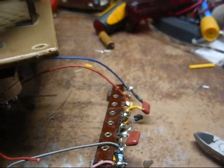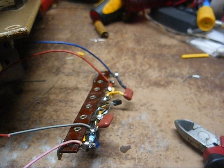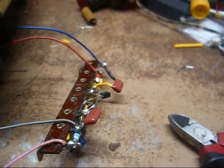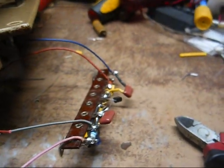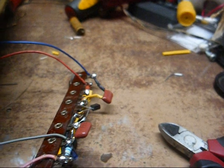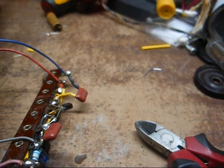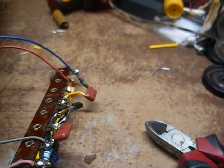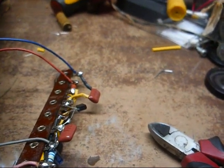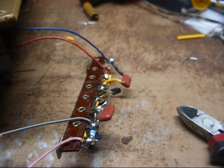And speaking of bogus parts, you have to be really careful about that these days, because a lot of what you get is not what they say it is. It's some bogus crap from China that if it works at all, it'll work poorly. I remember years ago I ordered some TV parts, horizontal output transistors and regulator ICs that were priced so cheap that it seemed to be too good to be true, which turned out to be the case. All the horizontal output transistors shorted as soon as power hit them, and the regulator ICs were dead as a doornail. So sometimes the cheapest price is not always the best deal.